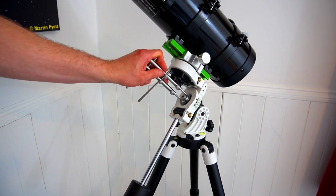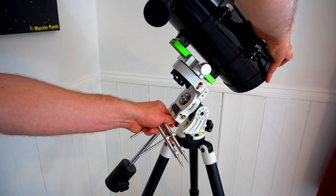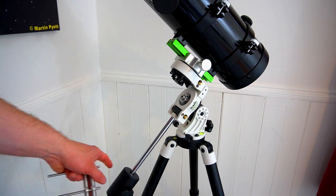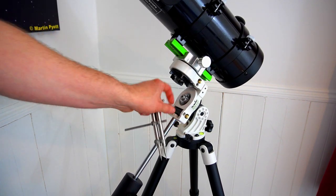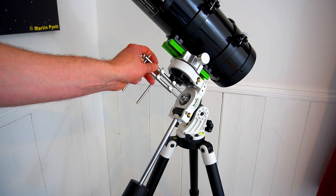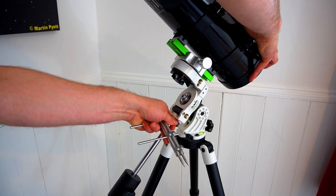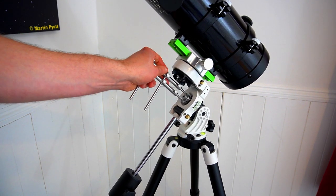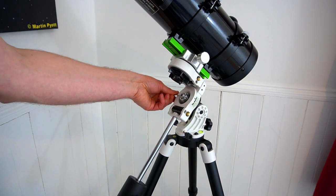So we tighten it all the way in, back it off. Okay, that seems to be okay now. It's not like it spins like a top, but the whole idea is we don't want free play in that axis. However, it is free to rotate, and it doesn't seem to be binding like it was originally. Again, you just got to keep adjusting it till you get the right feel. If you're slacking it out like so, we test it, see that? You don't want that, so you want to take that out. So tighten it, back it off. Much better.